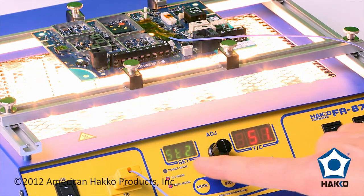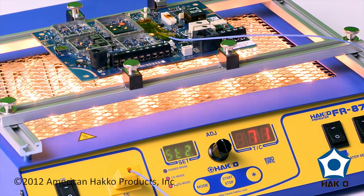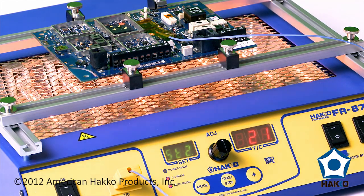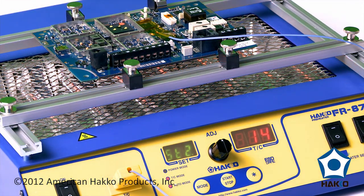We're coming up to the end of the first stage. Now we're going to start ramping up and we're in stage two. Our next stage target is going to be 75°C. Again, you see the lamps start to dim and flicker because it realizes it's approaching the target — we don't want to shoot way past our point; we want to be as accurate as we can. So we hit our 75°C mark and we're counting down. I'm mentioning temperatures in Celsius because that's how the unit is set up, but you can go into parameters and set it to Fahrenheit if you prefer.